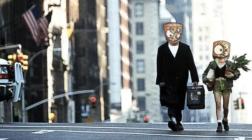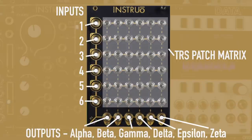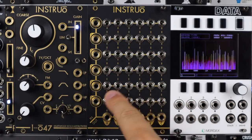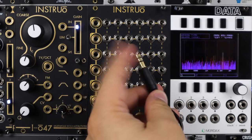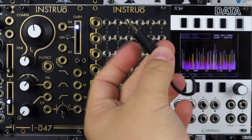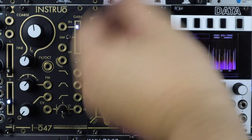Now Leon — not lion — Leon is a six input, six output pin style matrix. Ins and outs are DC coupled for audio or CV, and we have TRS jacks giving us some interesting capability for routing around a modular system. These pin style cables are TRS jacks, so to route an input to an output you plug one of these in, giving us this connection. Being TRS, the signal comes out and back in again.